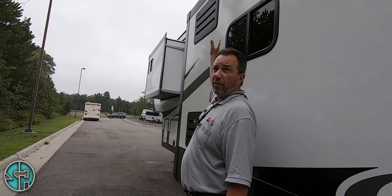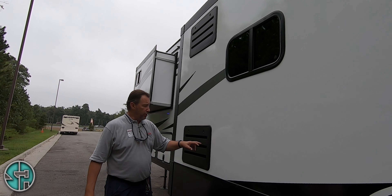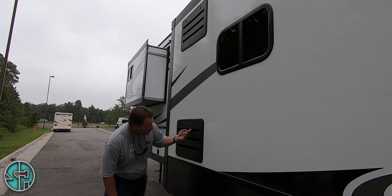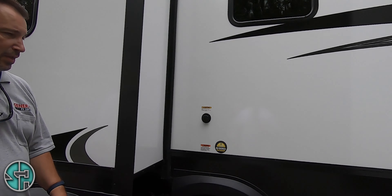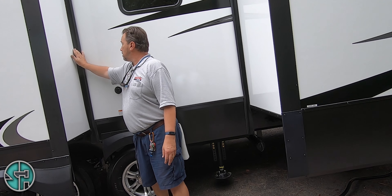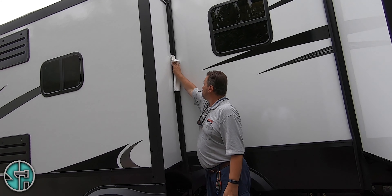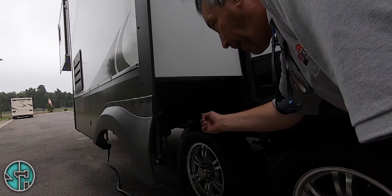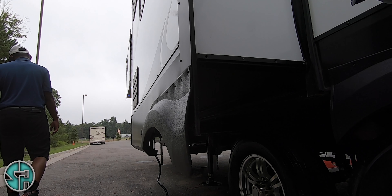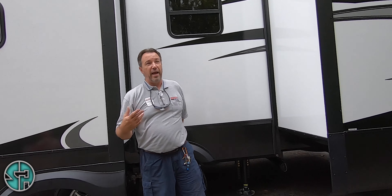Right here are the service panels for your refrigerator and your freezer. If they ever have to do any work on those units, they can just pop these covers off. I also suggest putting screens on both of those because bees can get in there and build wasp nests — you don't want that. With your slides on maintenance — using the six-month rule — on these rubber seals use what we call a silicone spray. Get a clean cloth, spray it, and just wipe it down the rubber. It keeps the rubber moist and keeps it from drying and cracking. Underneath along those tracks, use a dry lube spray directly on the tracks. Don't use WD-40 — it can gunk up with dirt and dust and keep those tracks from operating properly.